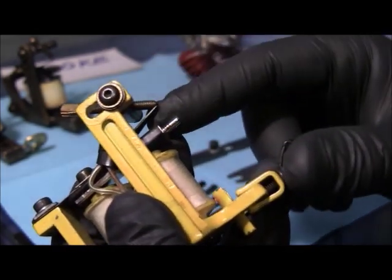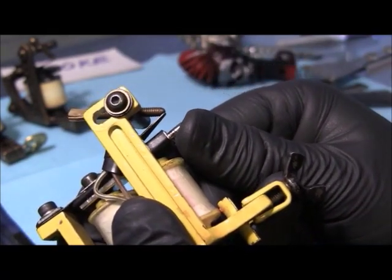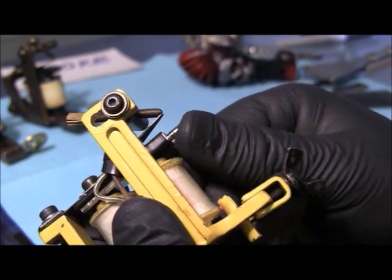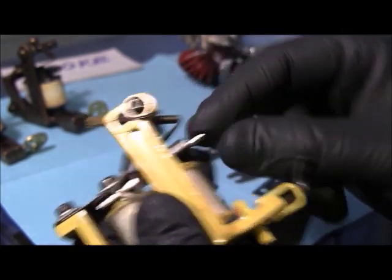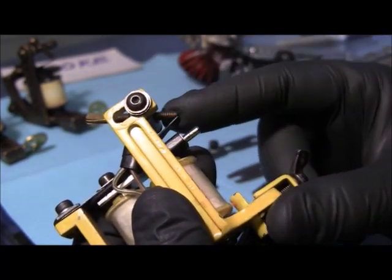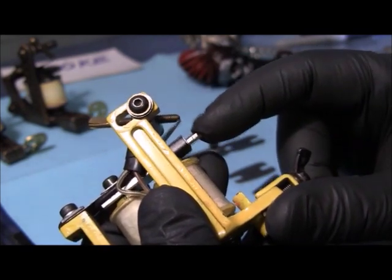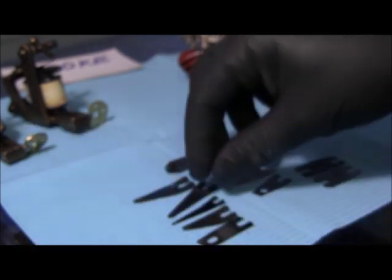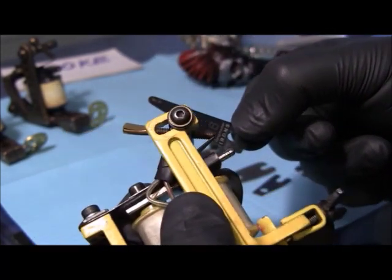And if you have a lot of spring here, your nipple will actually travel further because your spring will bend a little bit. So the bendier the front spring, the more travel you get, the more stroke you get, the more distance you get. So on a color packer, you need more distance, a little bendier spring in the front, a little longer bendier spring is what you would choose.